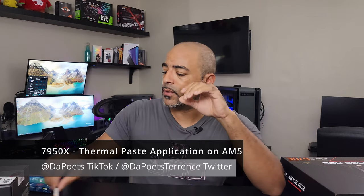There's also what I believe is a Thermal Grizzly Cryonaut here. A lot of water block companies like EKWB will include thermal paste — there's no label on this one, but I think it's Thermal Grizzly. Pretty darn good as well. It's hard to go wrong with name brand stuff, but in my experience I've been enjoying the MX4. Plus when I'm doing a lot of different builds, if I'm constantly using the same thermal paste, that eliminates some of the unknown variables instead of switching from one paste to another.